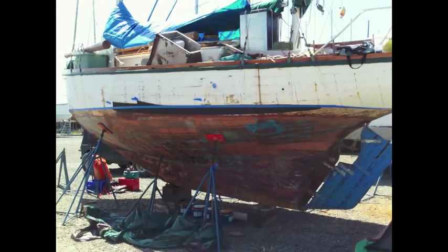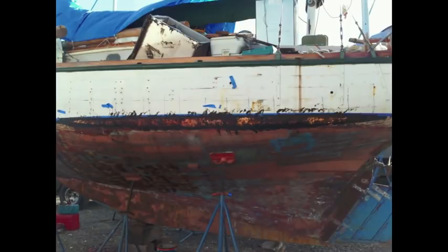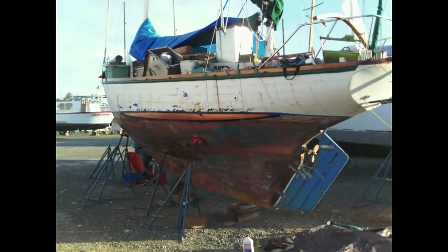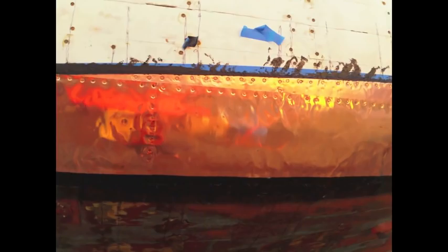just started. First thing to shape was felt, also called roofing or tar paper. It's hard to see, but next were the sheets of copper. Each piece custom cut and some serious tar laid between each layer. This is when I first earned my Tar Queen nickname. Just like sheathing this time around, it's so beautiful once you can clean up all the tar. On it went, tar, felt, tar, copper, leaving the felt long so the seams overlap.